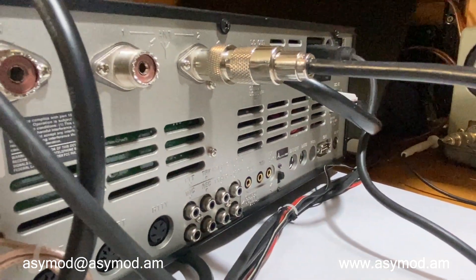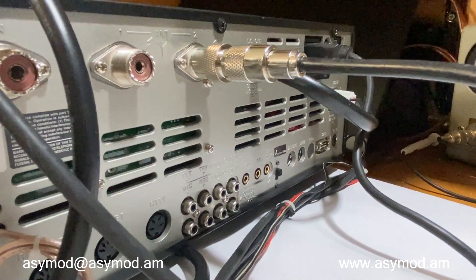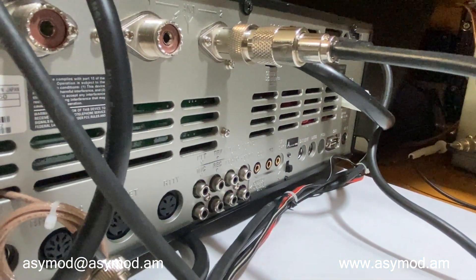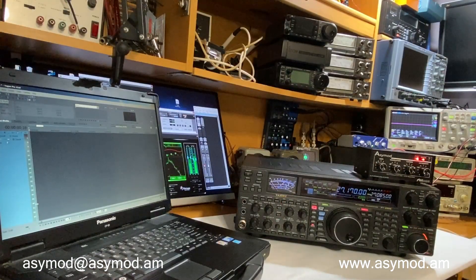The ACmod is for E-SSB or hi-fi asymmetrical AM. If you turn the switch off, the radio reverts 100% back to factory specs. Charles wanted this ready to go down to a watt or less — now he can go down to 200 milliwatts or less, up to 15 watts dead key. It is recommended not to go beyond five watts.